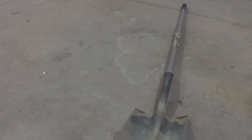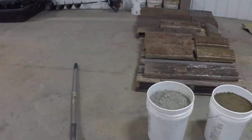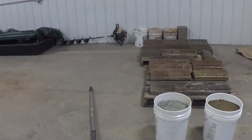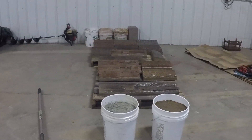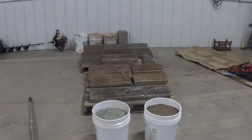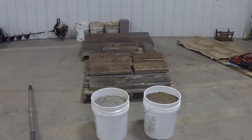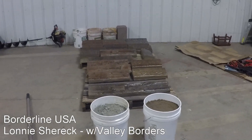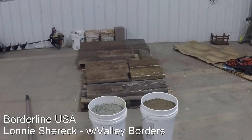We use 18 shovels, but it's a particular shovel — it's an eight inch by eleven inch square shovel. So if you have a bigger shovel and you're using 18, obviously your ratio is going to be different. We've tested this and you get about four and a half shovels per bucket, so it technically comes out to about 18 with this shovel. So what I tell you guys to do is just mess around with that a little bit. If your mixes come out better and it's easier to work with, then stick with it. If you like the old way, that's fantastic. But a four to one ratio — when people talk about ratios — this is what a four to one ratio is, because it doesn't go all the way to the top of that bucket.